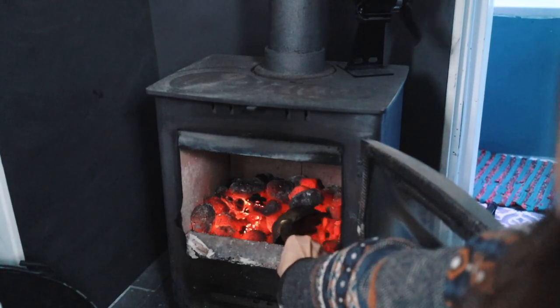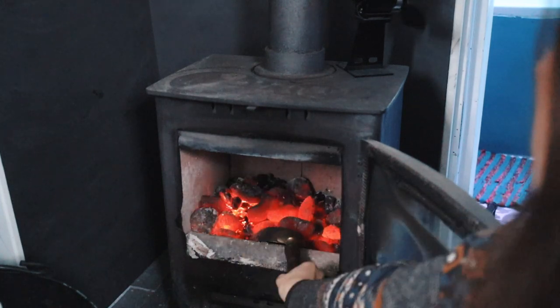So what do you need to do to keep the fire going overnight, or even 24 hours a day week after week? First, make sure you have enough coal in the stove. For our stove we load about a third to a quarter full of coal every time, and this way it keeps going for hours. Make sure your coal is high quality — many boaters swear by different brands, so try different ones because some might work better in your stove.